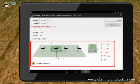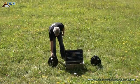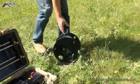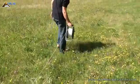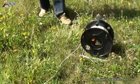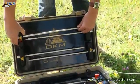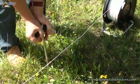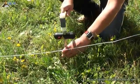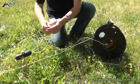Let's now apply these settings to our scan area. First, you are going to place the power box and both power cable drums directly next to the first scan point marker. Then you connect the right power cable drum to the power box and unroll it until the first cable marker appears. Take one power electrode and put it directly next to the cable marker into the ground. You may use a hammer to get it in. Finally, connect the electrode to the cable drum using one of the short extension cables.